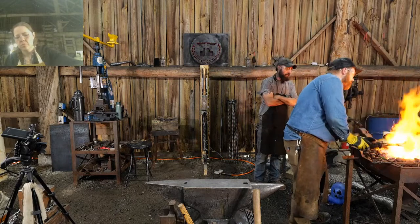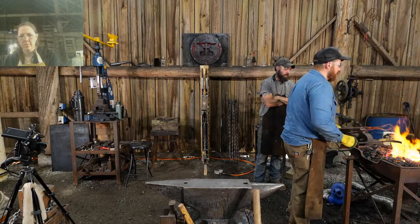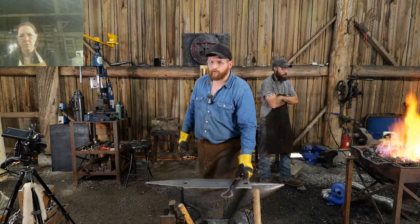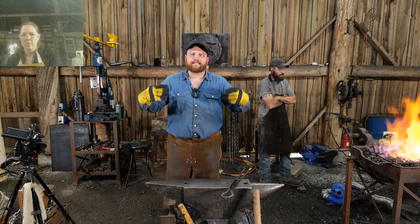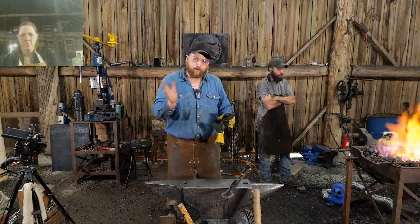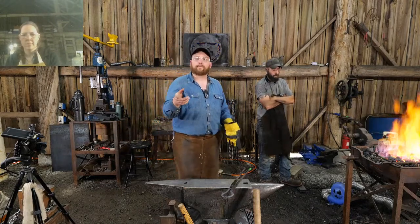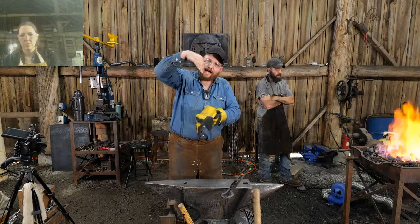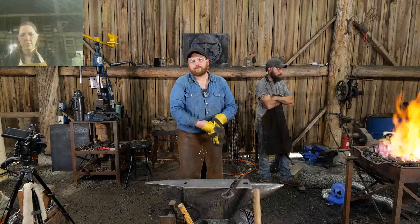So in smaller pieces, like smaller anvils that you might make, that's a perfect option to do spreading like that with a straight peen. But when you're working with something that has this much mass, everything has an anvil effect and it's resisting you. So it's very hard to develop enough oomph downwards to push that material out with just a straight peen. Now, if you had a press, like a hydraulic press, and you were coming down with a fuller, that's a lot of squeeze force, so you're going to divide up the material a lot more effectively than with a hammer of this sort.